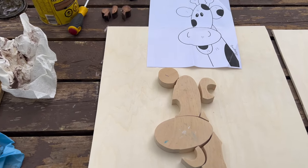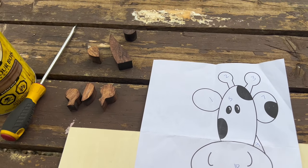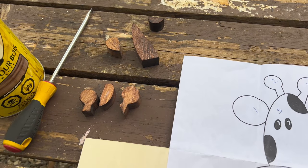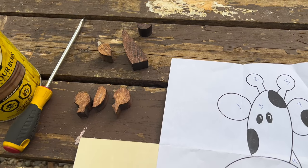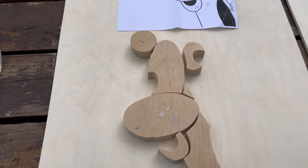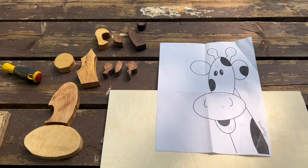I started and stained the pieces in the red mahogany and it's not quite as dark as I want it. I've done two layers on one piece and only one on the other, so I'm going to play around with that and build up the color to get it nice and dark. It's not quite as red as I want it but I think it's still going to look great. Now we'll continue — I'm going to sand off that paint and then work on doing a golden oak to a natural. Here are my pieces stained all the different colors; we're going to let those dry and then put them together.